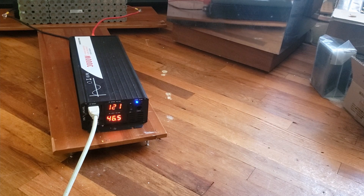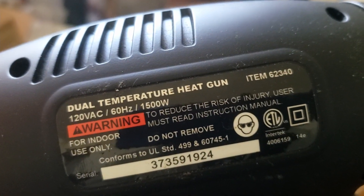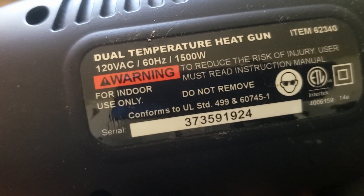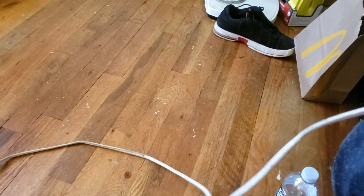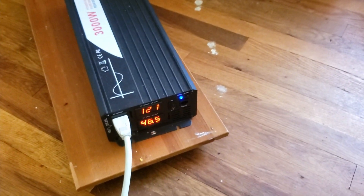The test was successfully done. We tested the inverter and it produced 3,000 watts. We were not able to test the 6,000-watt peak for the time being — we need more tools to do that. Right now, this load is about 1,500 watts and this one is also about 1,500 watts. Two loads at 1,500 watts each gives you 3,000 watts. So the inverter is truly 3,000 watts.